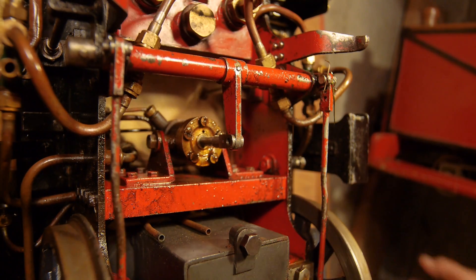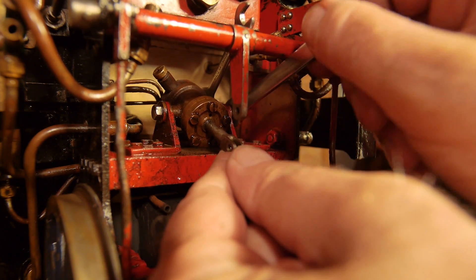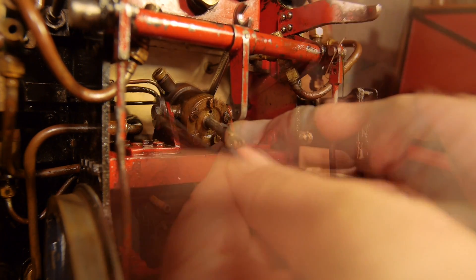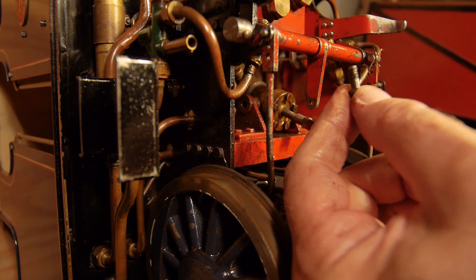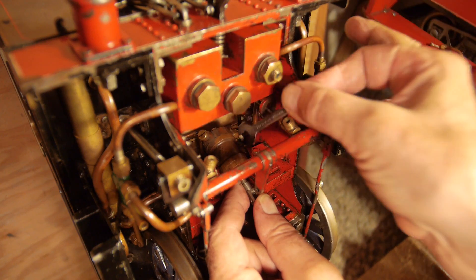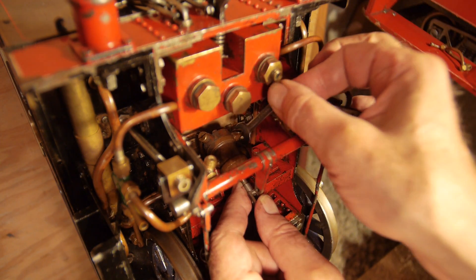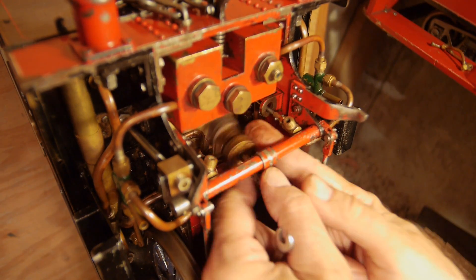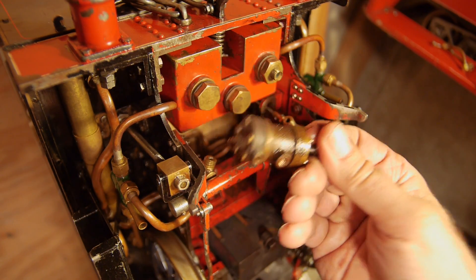I've decided to take off the two hinge set screws so I can get to the steam supply connection much more easily. These are pretty tight, which is a good thing. I've finally got the little stud out of the pivot on the steam brake. Now I can move it a little bit to get at the steam connection — a little bit difficult to get the spanner on, but I've finally got it out. There is the steam brake cylinder.